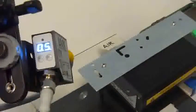This is a brief demonstration of the UVX tin side detector. The sensor detects the tin side of float glass by using a special UV light source and projecting that light onto the surface of the glass. The tin side will emit light in the visible spectrum, and the sensor measures the amount of light and allows a threshold to be set that triggers.